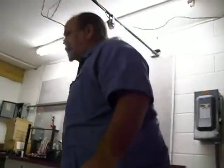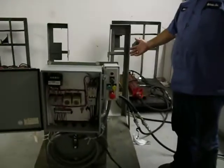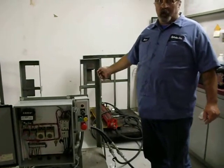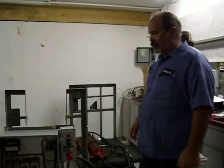That's how you set up timers. On this machine, it runs bypass and non-bypass cylinders. It will shut off in reverse on time and/or pressure. If you have bypass cylinders, pressure has no effect — it will time out on time only. If you have non-bypass cylinders, set your timer for longer than what it takes, because you want it to come all the way back, build pressure, and the pressure switch will shut it off in reverse. Pressure switch settings are already done at the factory. All you need to do is follow our video on pressure switch settings to readjust it.